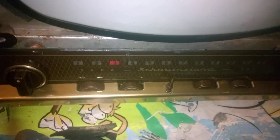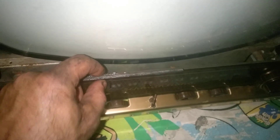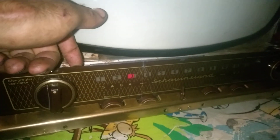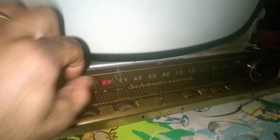I'm not going to make a reproduction for now. As you can see I used a piece of steel angle — on the back side of the glass there is paint, and if you glue a piece directly to the paint it doesn't offer any rigidity, because if you try to flex it, the paint will just shear off and the glass will break again. So I used an angled piece of steel glued to the back and also to the top and bottom of the glass, so it's really really strong. I'm not afraid it will break unless someone punches it.